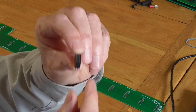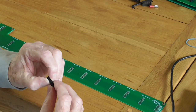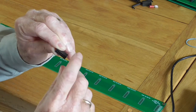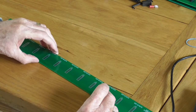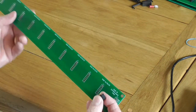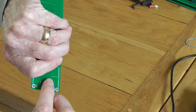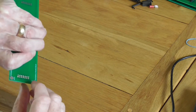This is the connector you need; it's fully described in the construction manual. It's called a two-times-seven-way DIL socket, because the sockets are seven in a row in two rows of seven — so altogether they're fourteen-way, arranged as two times seven DIL. DIL stands for Dual In Line, and they are PCB mounting. You check that you're looking at the OLED side, then put the first connector into the holes on the board so the legs of the device stick through the holes — and that's where you solder.